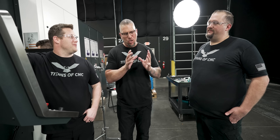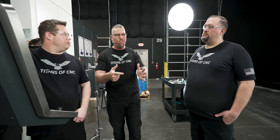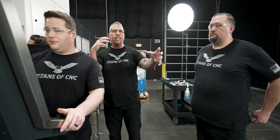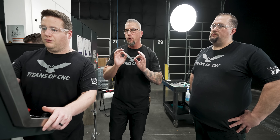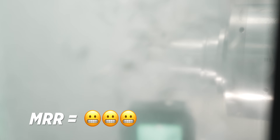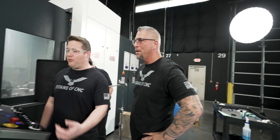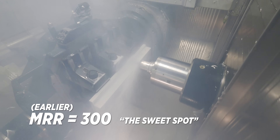Full slot. Now we're just changing it, right? You're taking a huge step over. You got 4,000 RPMs, but now we're going to double our feed and we're going to actually make it happen. You're taking your MRR up. So depending on what type of machine you have, you just take a different approach. We're showing you something different, but the MRR is going up. That's the kind of boom you don't want. Every time I run one of Barry's programs. So we broke an end mill on this cut, and on this machine, those RPMs are simply too low.